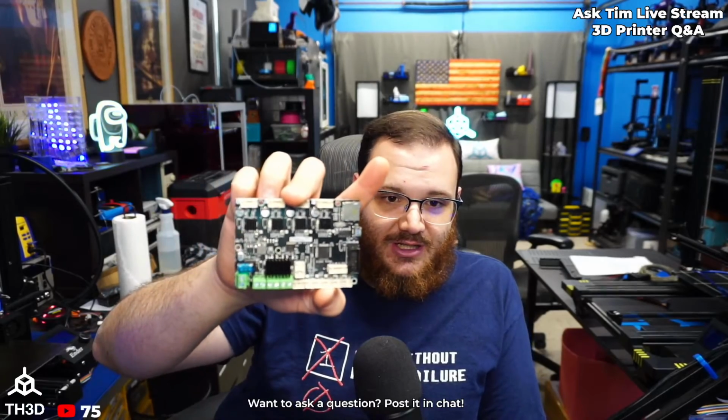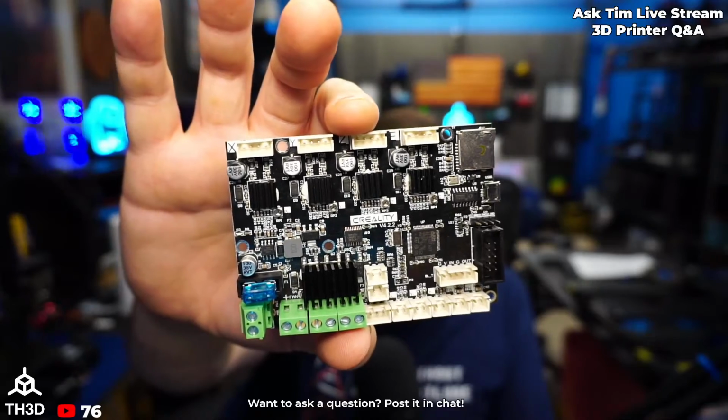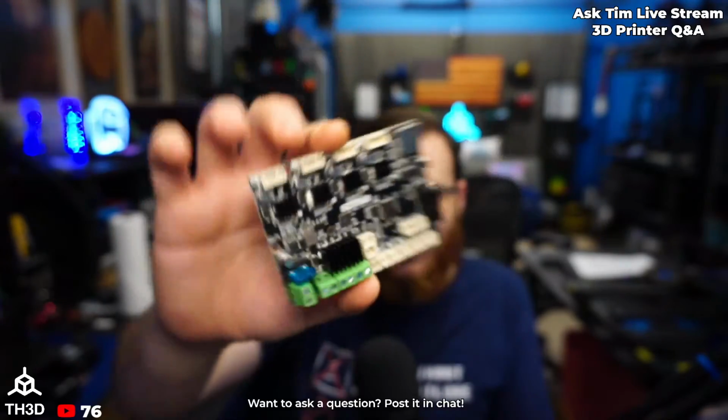I did power. I looked up the part number that's on the 5-volt regulator for these boards, because there is 5 volt on the BL Touch header. The only thing is, when I turn the LEDs on full brightness, the screen dims, which means I'm pulling a lot of power from the regulator. Even though the regulator, according to the spec sheet, says it's up to 3 amps, I don't think it's reliably putting that out. They do have a fuse, F2, right above that little gray square on the left side that says 100. I'm assuming they have a fuse at right around an amp. So I would definitely recommend using the universal adapter if you're using the Easy Neo with the 422, 427 board.